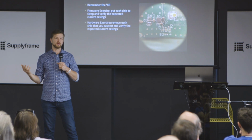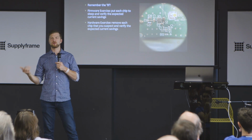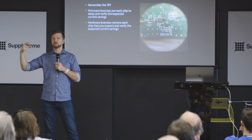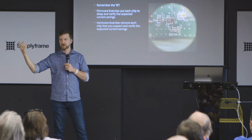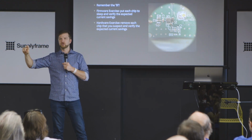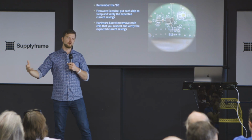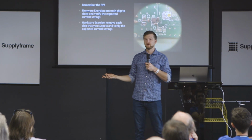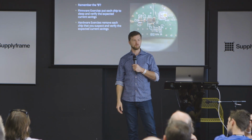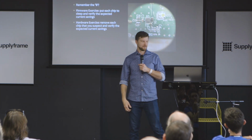It's very common. If you forget to connect, like, a solar panel, believe it or not, your circuit can consume more energy than if it was there, because it was expecting a load at the input of your charge circuit and it wasn't there, and so you're using more energy than you thought. I mean, by microamps, but it's still enough to get you running around your lab for a couple days wondering where the hell all this power is going.